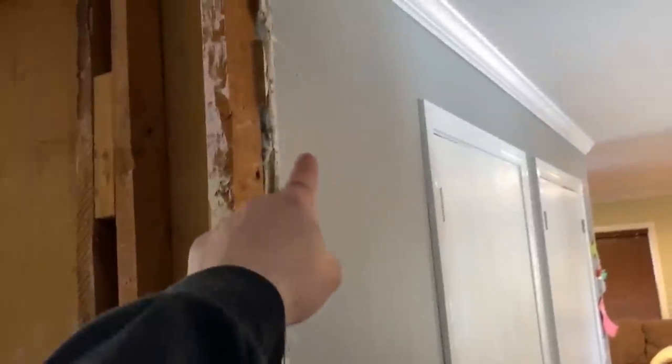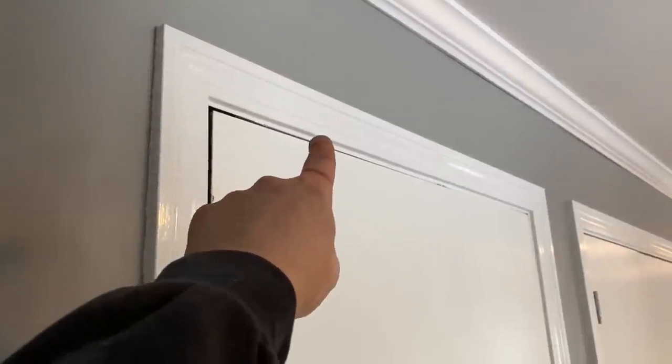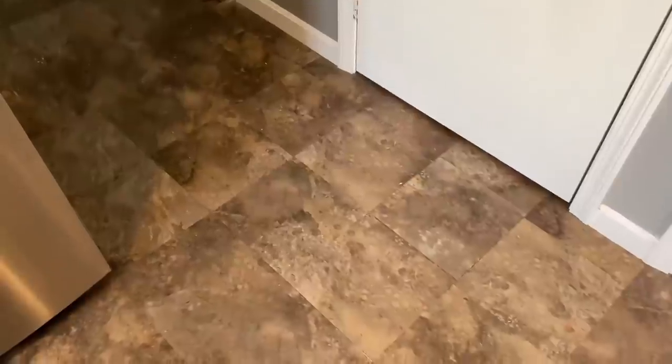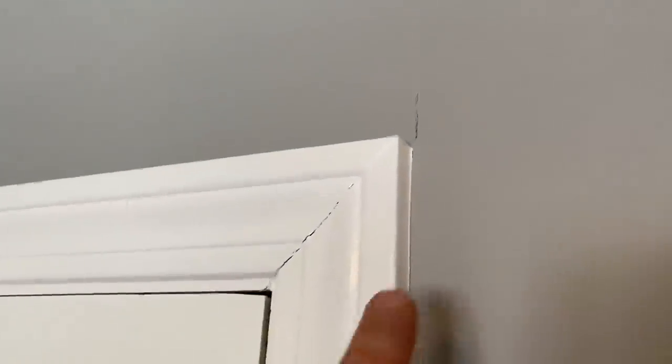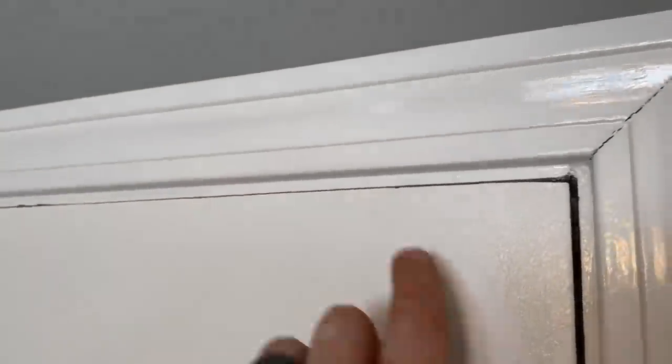And I just wanna take the weight off of this side, but more than that, and if you've been following along, I want to take the weight off of this wall because this is a 2x3 wall with headers that are not proper where this door is. And as I lifted the floor up, you could tell some things were happening here, cracks, and this reveal got smaller. I actually locked myself in the basement for a minute.